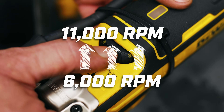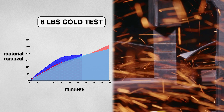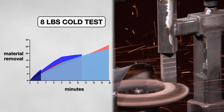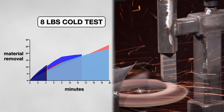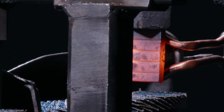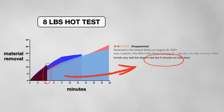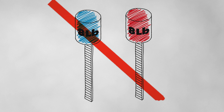To find out for sure, I brought the grinding speeds back up to 11,000 RPMs but switched out my 4 pound weight for 8 pounds. When I started the experiment on cold metal, it started off with a bang — cutting away material fast, since more friction should mean more material cut. But it wasn't long before that generated heat caught up. A little after the 4 minute mark, I began to see smoke and damage to the disk, making me end the test. The coupon measured 11 and a half inches cut — not bad for material removal, but the life of the disk was definitely cut short. When I tested it again against heated metal, the results were nearly the same, if not worse. Now I'm starting to see where this negative review came from, with their disk duration almost exactly lining up with the results. The extra generated heat from the added friction severely kneecaps this disk's performance.